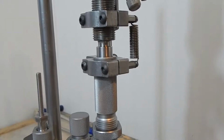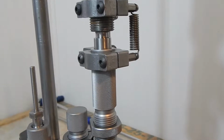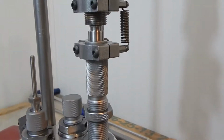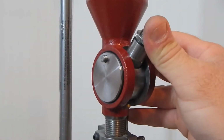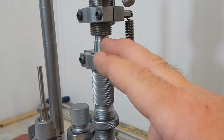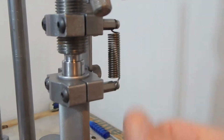Well, I've loaded a lot of casings. Maybe this needs to be cleaned up, our push rod assembly in the lower end. I pulled that apart and cleaned it. It had a little bit of metallic film on it. I didn't really see an issue, but cleaned it up anyway. Reassembled it. Fifty to sixty casings later, the metering assembly hangs up again. So the next step was to disassemble again, and I put a real light grease on this push rod assembly, seeing if that would help. I checked out my return spring here. It was in good shape.